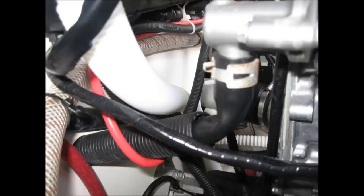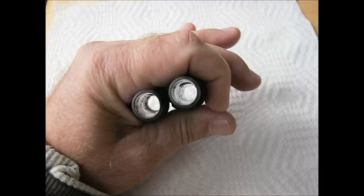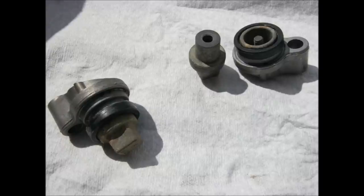Another item to check is crimped cooling lines. In my case it turned out to be incorrectly molded Y fittings that left plastic flash inside which restricted flow — this was easily remedied by punching out the plastic flash with a seven-sixteenths drill bit. Also check the three holes on the exhaust pipe, which can become restricted with salt or corrosion due to incorrect flushing methods. You can check the condition of the inside of your engine by removing the anodes on the starboard side and looking inside with a mirror and a flashlight.